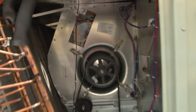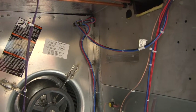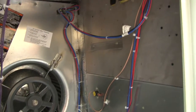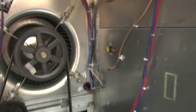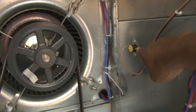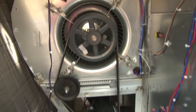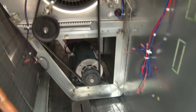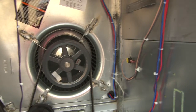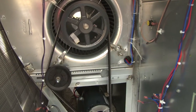The other components we're going to take a look at is the blower motor. In this blower section, you can see the power coming in. We have a safety control located right there, sensing temperature. We have the blower motor — it's mounted at the base with a blower wheel connected to a sheave and a pulley.